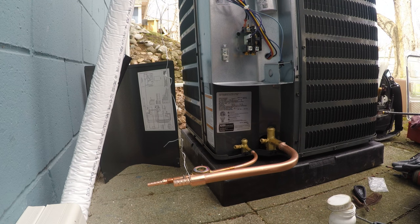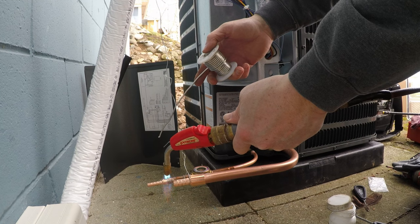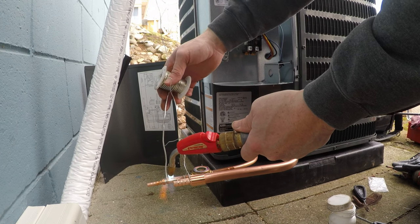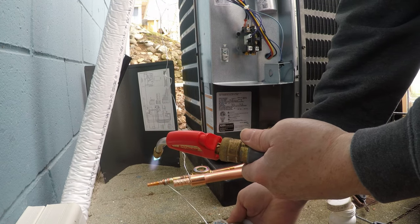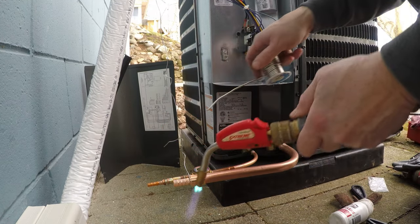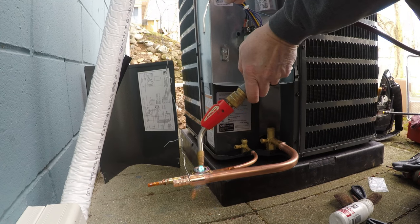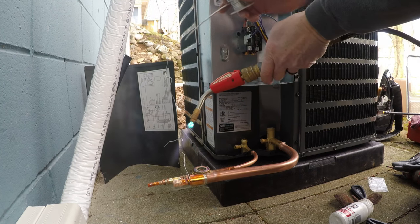Yeah, make sure it's on right here. Turn it on, you'll see the gauge. Okay. Turn this on a little bit. Heat it up towards the back, and you run your solder on. Just touch your solder, and the heat draws it in. Kind of move it back and forth, and focus on this area. See how it's pulling that solder in?